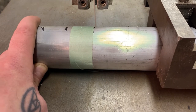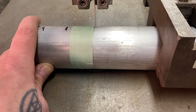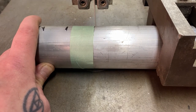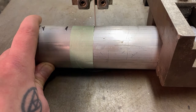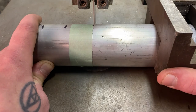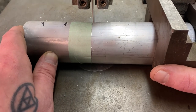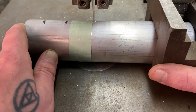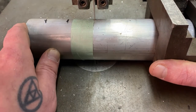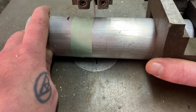As you start the cut, it's much faster than as you get towards the center. You want to be mindful of the angle of your piece, but expect it to turn a little bit. As I'm moving forward, my piece of aluminum is moving a little bit — I'm cutting by hand, so it's not going to be perfect and you will have to compensate and move back and forth. Just make sure you're not twisting the blade and try to stay on target. You're going to get a little bored, especially on a piece like this — it's going to take 15 minutes or so — so just stay focused. If you feel strained, back the piece off, turn off the bandsaw, and take a break. Just go with the front of the blade; that's where all of your action is.